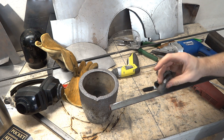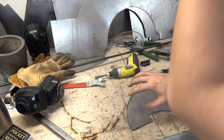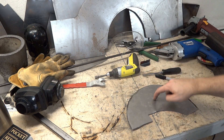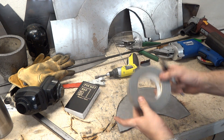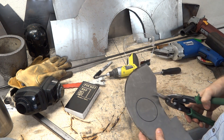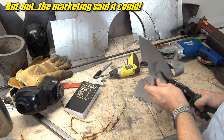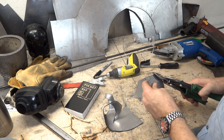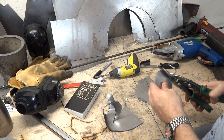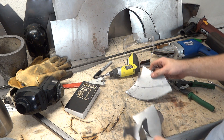It's steel, so I'm not going to be getting it hot enough really to melt the steel. The degasser is like a little plate — you want it kind of domed and full of holes with the rod coming out, so you can put that little packet of degasser in and plunge it to the bottom and kind of move it around. The holes will allow it to bubble up through. We're going to make it from this — a cutoff from the fender of the Jeep. Inside of this is probably the right diameter. These electric snippers don't do tight radius corners very well. This is 20 gauge steel — I'm not going to be using it under the metal for very long, just a few moments during the degassing, then I'll remove it. No big loss if it doesn't work.